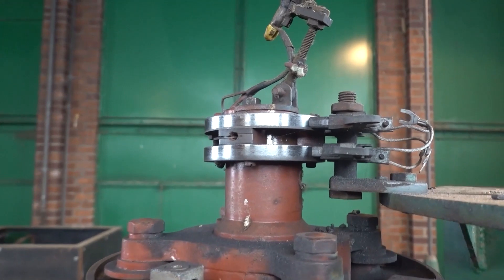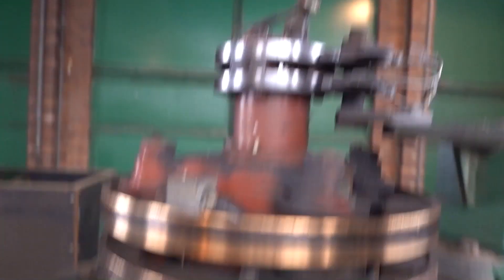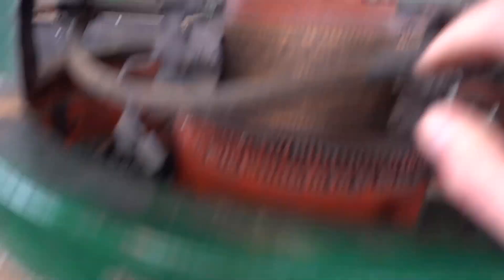For those of you who commented in, some of you got it right. Down below me is the big generator. Now this generates, assuming our big shaft here is turning at about 200 rpm, this big generator generates about 2,400 volts, three-phase, at up to half a million watts, which is pretty cool.